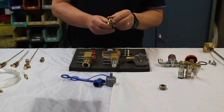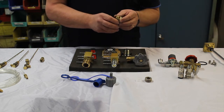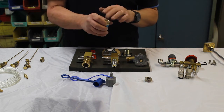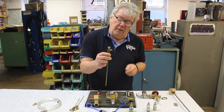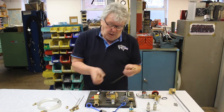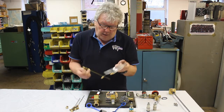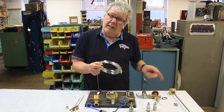Next is the pressure relief valve. The pressure relief valve is in there so that if your cylinder overheats for any reason, instead of blowing the cylinder up, the valve will open and release the pressure and then close again. It's very important that it's kept clean — there is a dust cover to go on. Regarding the thread on top, we also offer a safety tube here. Instead of having a plain nut on there, this one will be screwed on, and as we plug into the fitting over the side of the basket outside of the trailer, you will vent the propane vapour.